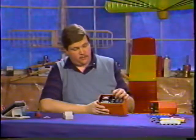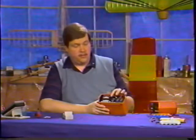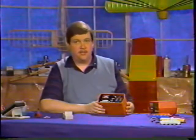It's effectively the same as the other peak detector charger in the way it works. You connect the batteries to the appropriate output terminals, select the amperage that you want on the meter, and then switch it on and forget it. When it sees that peak, it automatically shuts down to a trickle charge. So you come back, and if the meter is all the way back to zero, your battery pack is charged.